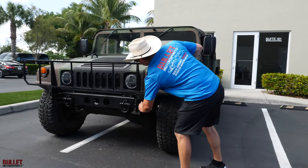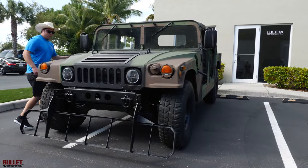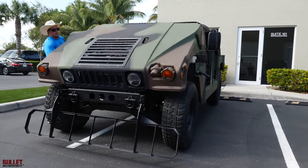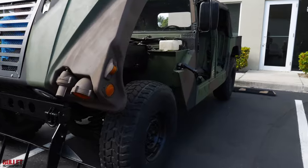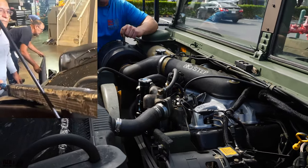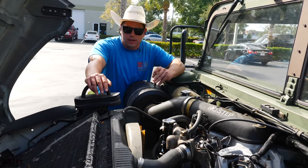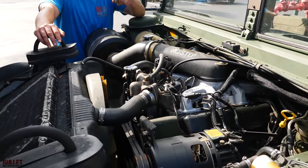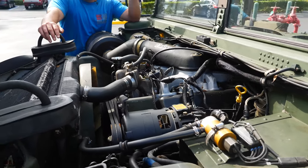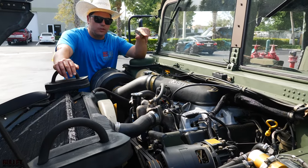So we tore it all apart, re-gasketed it, new injector pump, new injector hard lines. It was a fun one because we couldn't figure out why it was running rough until we pulled it apart. We pulled the water pump off, the whole top end off — both heads were removed. We have documentation, so when you're buying this we're not just saying it was done, it actually was done. It has all new fluids and filters, new belts, replaced the generator with a rebuilt unit, checked all the brakes, all the lights operate as they should, stays cool with no overheating issues, new fuel filter, new glow plugs — whole nine yards.